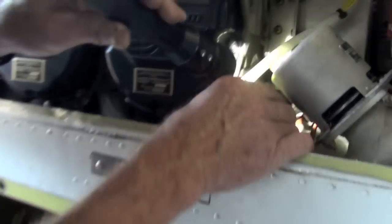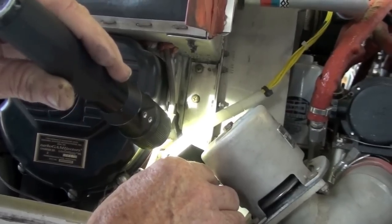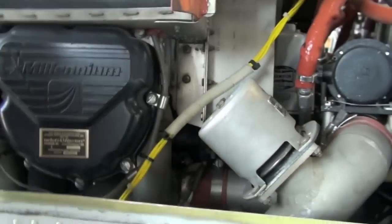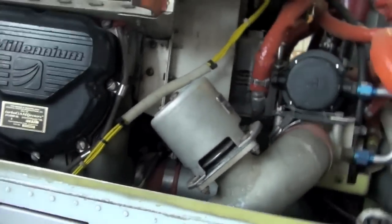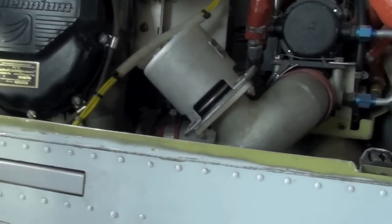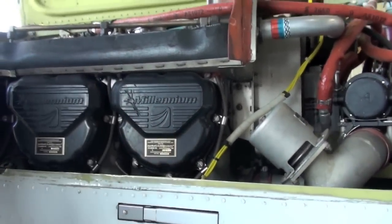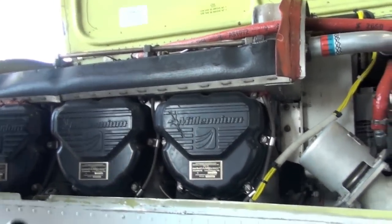This is your oil temp right here, so the cannon plug is loose. Oh, I see. It's very difficult to get to, but it's going to get worse and it's going to come off. Are you having any oil temp indication problems? No. No erratic movement on the needle? It's going to get worse. You might want to get home and get it tightened up. Okay.